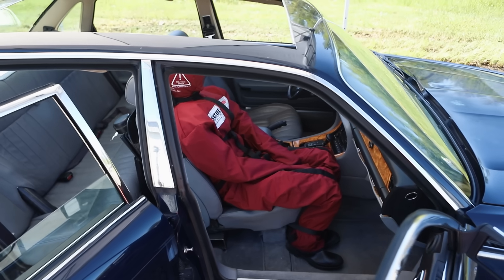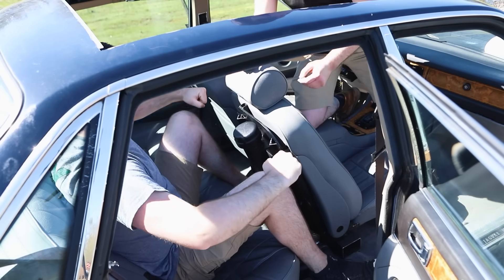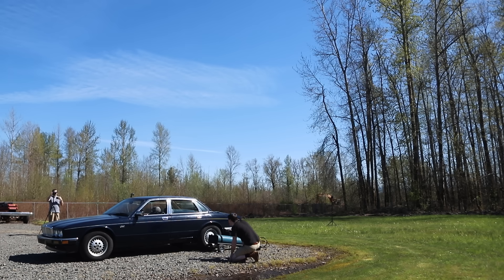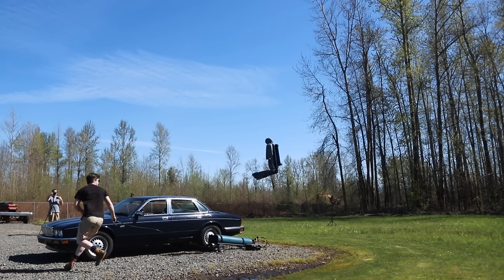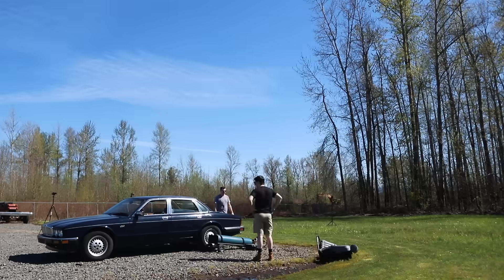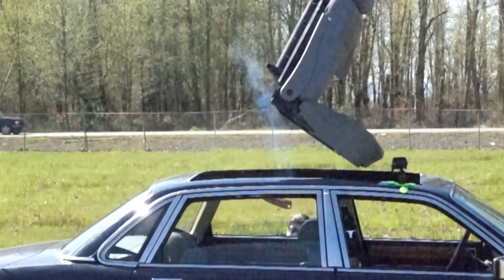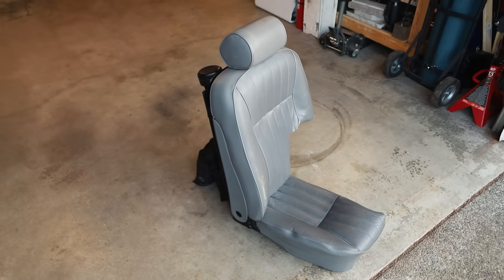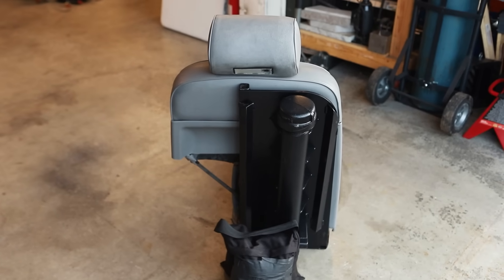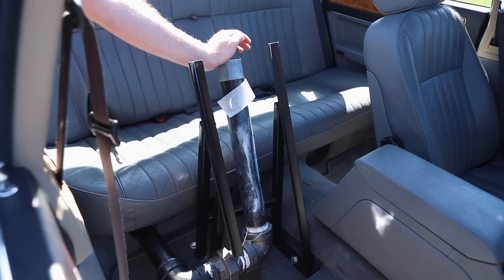I'm working towards being able to launch this dummy to simulate a human. Empty seat in 3, 2, 1. That's where I was sitting — that's not good. It traveled sideways. So actually having the dummy in there is going to rotate it even more forward. A couple things caused the chair to tip forward and not fly straight: with the chair being notched and the cannon sleeve being on the backside, it was very unbalanced. And the cannon tube wasn't fixed, allowing it to tip forward. I was relying on the guide rails to keep the chair straight.